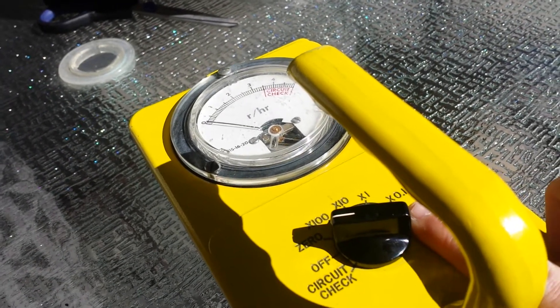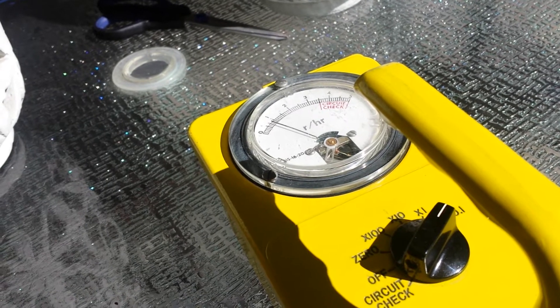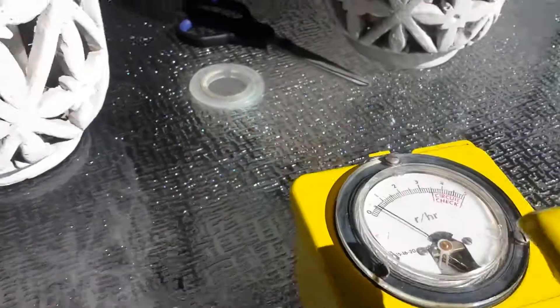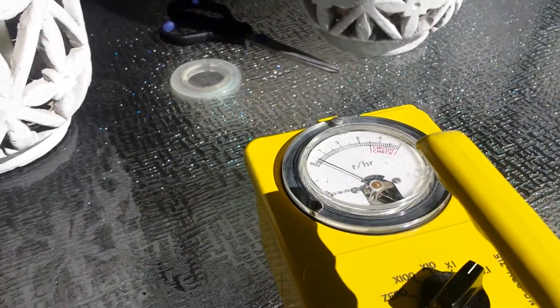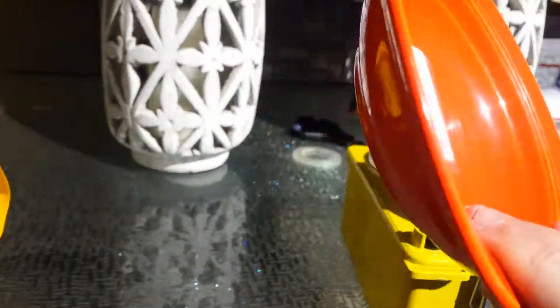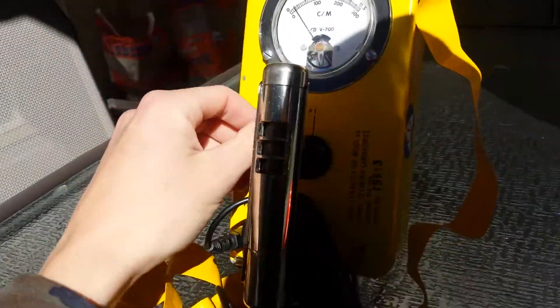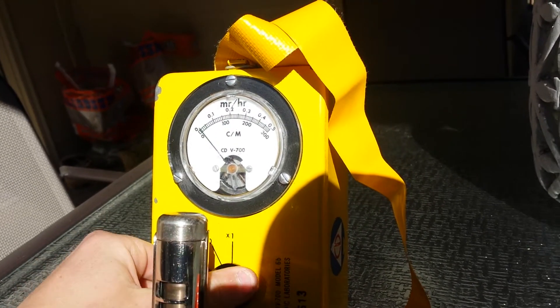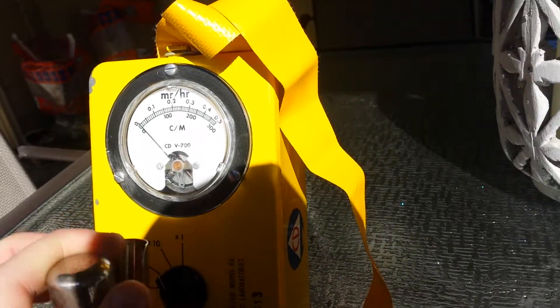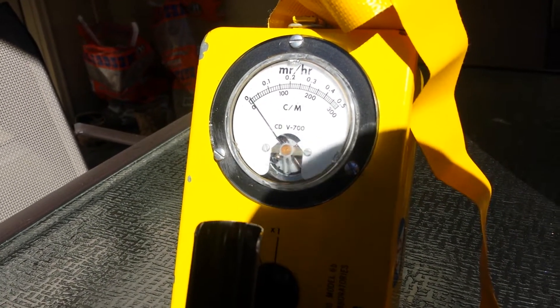For the demonstration, I'm going to put it to the 0.1 scale and I'll show you why I'm doing this. So there's our 0.1 and it's already going a bit and it's going to slowly go down. Now here's something interesting I found out. A lot of people said that it only detects high dosage. So if we take our FiestaWare from the other video with the CDV700, let's take our probe here and set it on the 10 scale so we can get a view for what we're doing, and put it up to our FiestaWare.